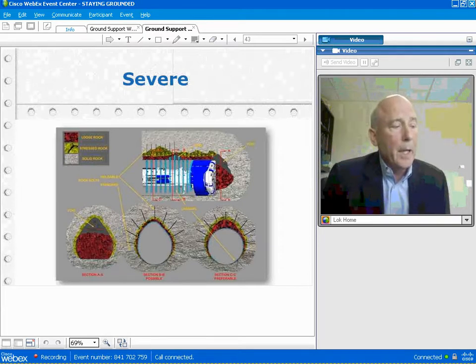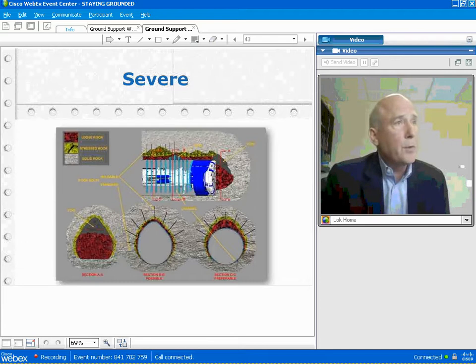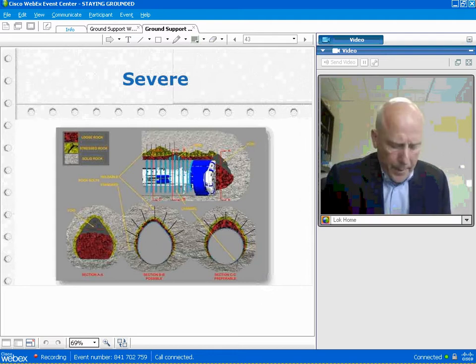And if we achieve that in those sections, I think we've done a great step forward, and I think it's doable. Because, of course, the advantage of tunnel boring with a machine is that when you're in good ground, absolutely no drill and blast operation or NATM can even get half the rate. And so the goal for us as TBM designers should be, and that's why our company is at least focusing on this a lot, to try to be able to duplicate the advance rates and the support techniques that are available and used in NATM.